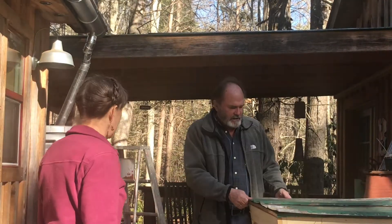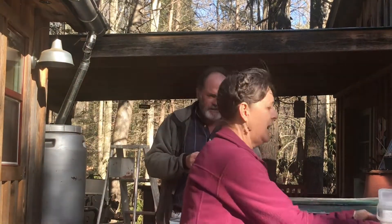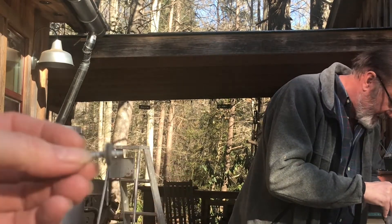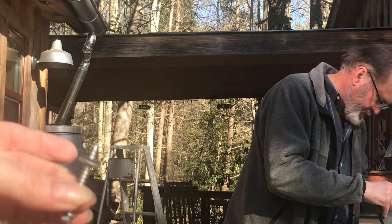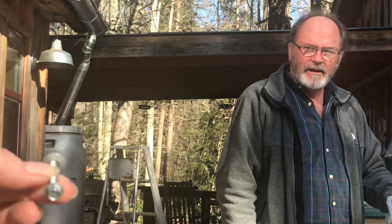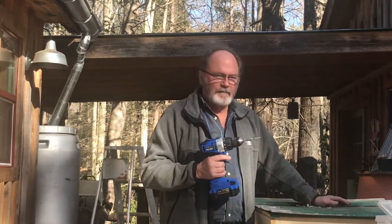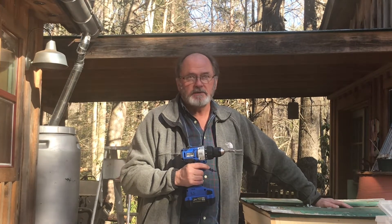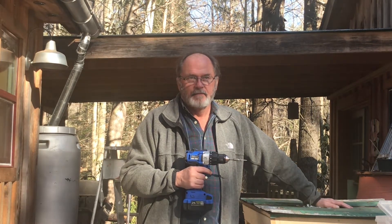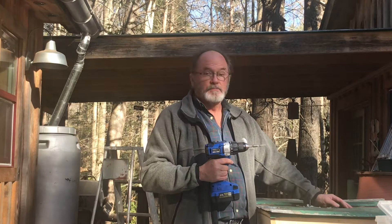There's plenty down there at that end. What do we fix this with? Screws that have a gasket on them. Here's a view of the screw with the gasket. You have to get it in just right — if you drill it too far down it doesn't seal, and if you don't put it down enough it doesn't seal either. We've decided to put a screw everywhere there's already a hole, as much as anything to plug the holes, and then add more screws where we need them. We're debating whether we really need to pre-drill holes or not, but we'll try it without and see what happens.